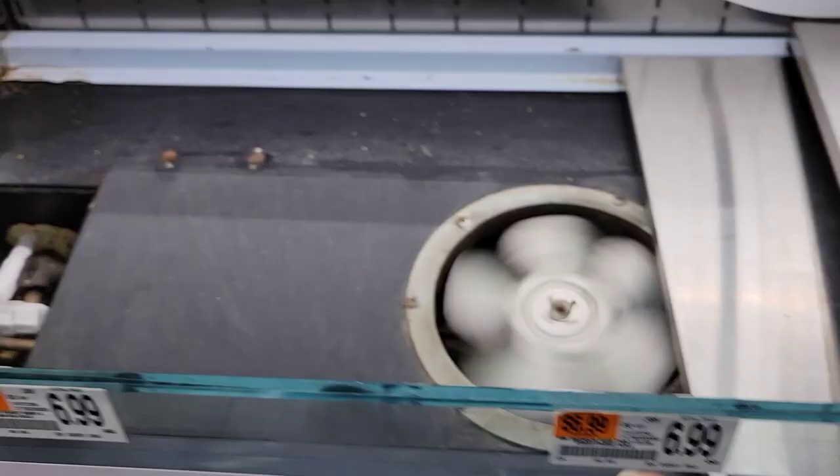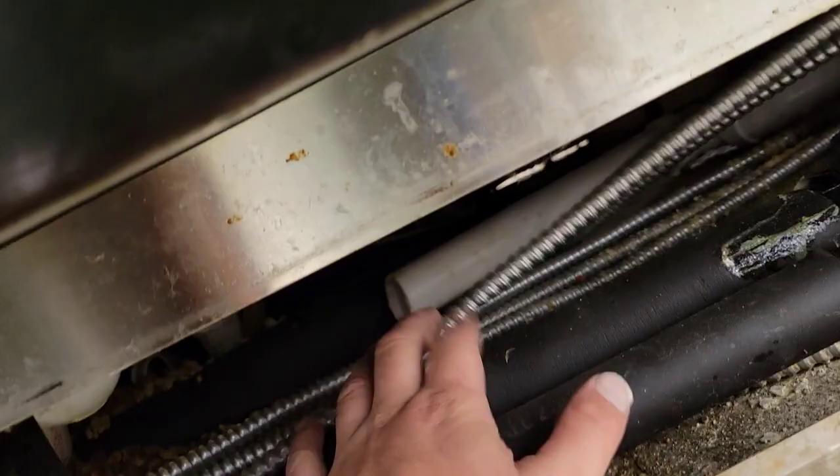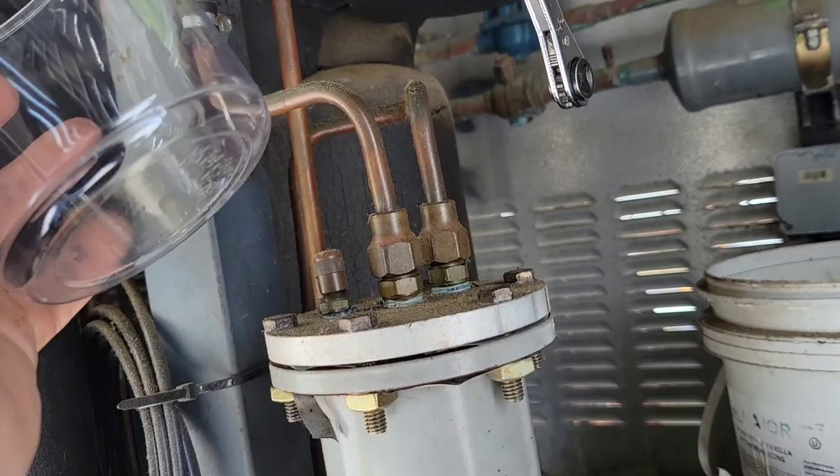So what I do - this is a loop system, so that means right underneath the case you've got the pipes. I turned off this pipe and now we're letting all the refrigerant run through and do its thing. What we're going to do is get our recovery machine and recover it from here over into the suction side. I'm up at the rack.